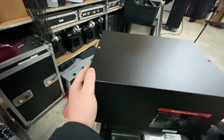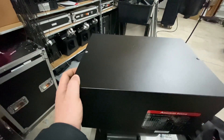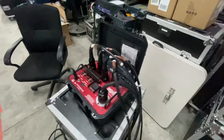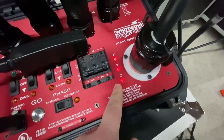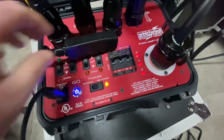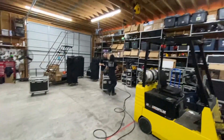You kick it on — make sure you have your breaker off on your main controller. That's the grinding noise I was talking about. But over here now you can see we are generating X, Y, and Z — we have all three legs. Now we can actually turn the controller on and we are powered.